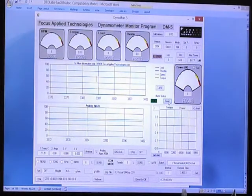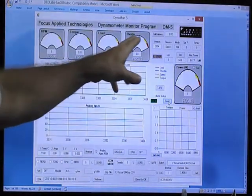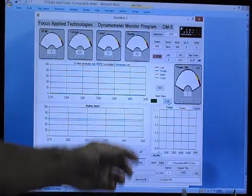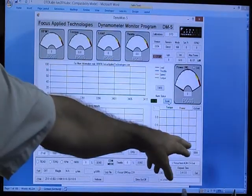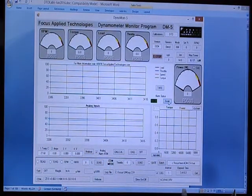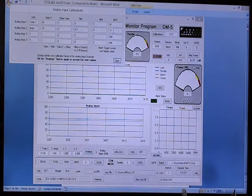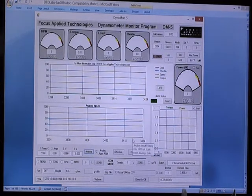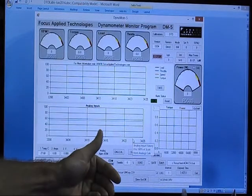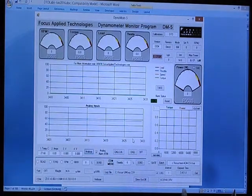So that's the experiment we're about to do. We'll spin up the motor at about 50% power and it will go to a high operating speed. We will then increase the load on the motor, tracing out the motor torque curve. Once we exceed a certain current, we've set an alarm to shut off the current at about 15 amps — when we get to about 15 amps, we'll shut the current to the motor off, protecting it. There is a circuit breaker in the universal power supply, but this is a more elegant way to do it. So let's spin it up with about 50% power.